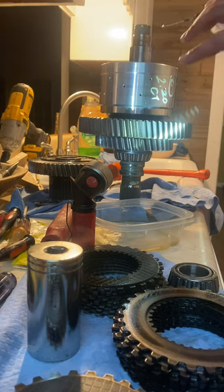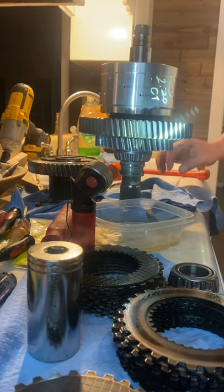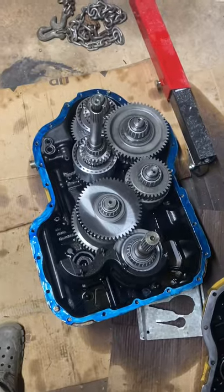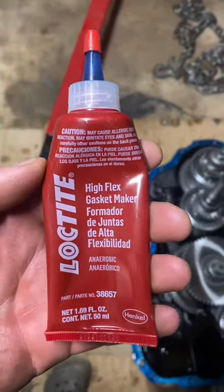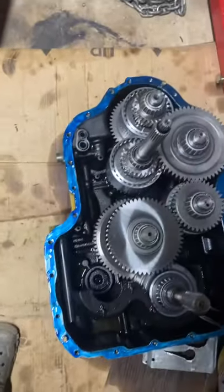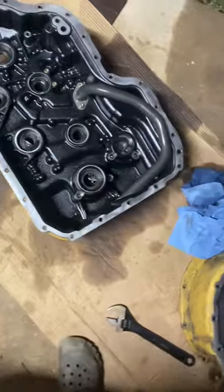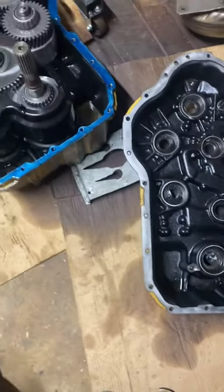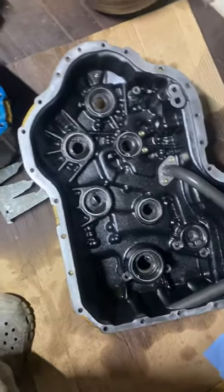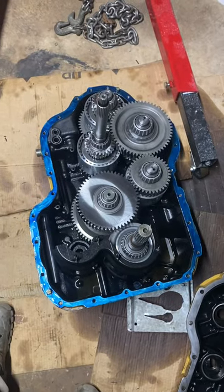I'm no professional, just taking mine on. I'm doing this on my kitchen countertop. I just know a little bit about my machine. You take this black high-flex gasket maker, put it all the way around the bead, clean both surfaces with brake cleaner or acetone, clean both sides, then you flip this over and set it down over top of all that. Probably going to use the hoist for this, but that's where I'm at now — about to put it back together.